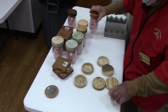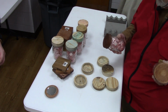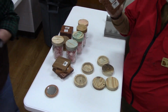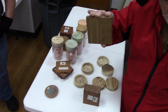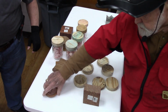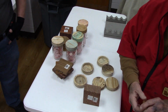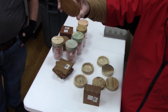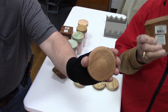I've got these jars, or, this is African Padauk wood here. I don't know what this is. I buy this good wood from Rockler in blocks like this, cost about $7. And then I take and cut a 3/4 inch block off the back because the hole saw will only cut 1.5 inches. And then it gives you these blocks, you can make these little mirrors out of. That's a good mirror. It is. And I make these, I've sold them, give them away for Christmas. And women love these for Christmas presents and stuff. So you get two projects out of one piece of wood.